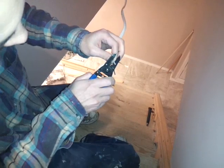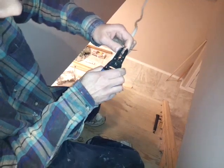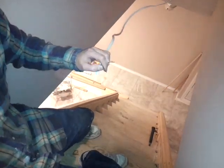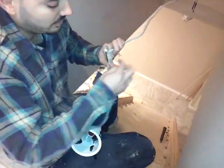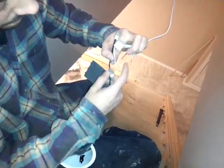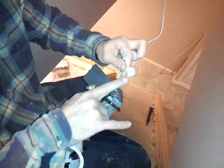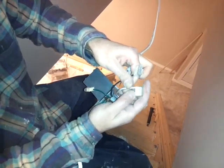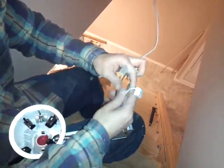So you just strip these with a stripper. You have the black and the white. When you connect them in series, you just plug them in — white to white, black to black — and the green is ground. If you want to connect another one, you take another wire, connect white to white, black to black, and ground to ground, and run it to the other light. You can put three extra connections in here — that's how you run them all on one circuit.